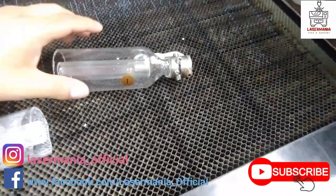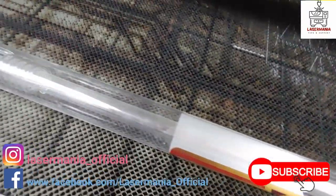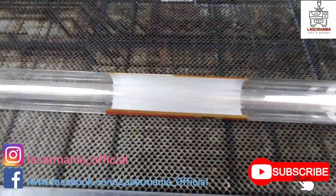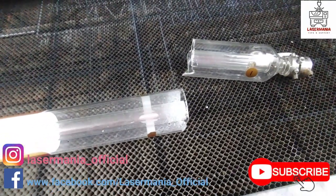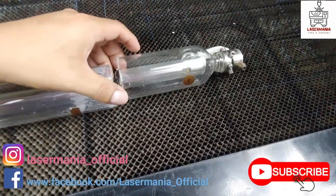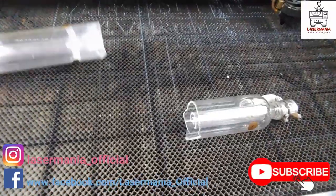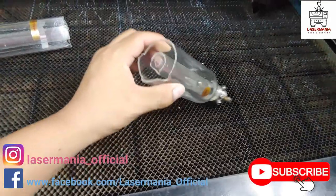This is the output where the water exits, and it also has a water inlet here. The water passes through the tube to cool it down — otherwise the heat generated by the beam will break the glass sooner or later. I wanted to cut this tube through to see a little better the anatomy of a laser tube, so let me show you.